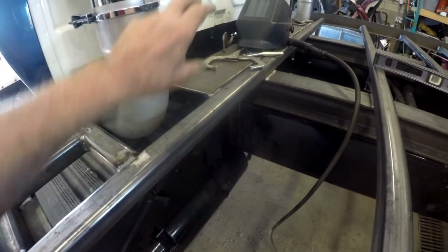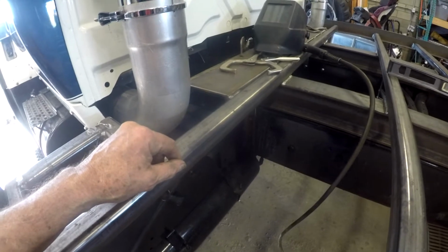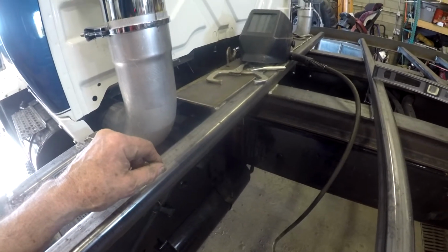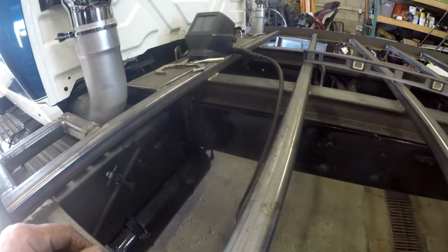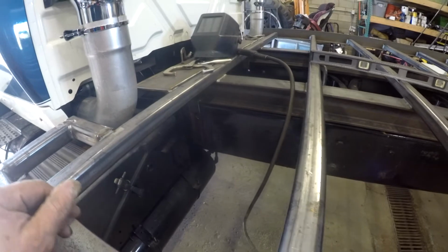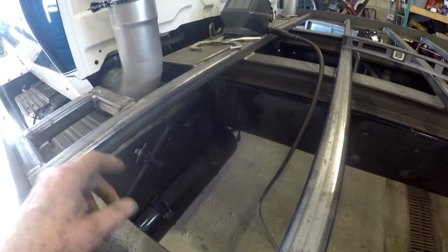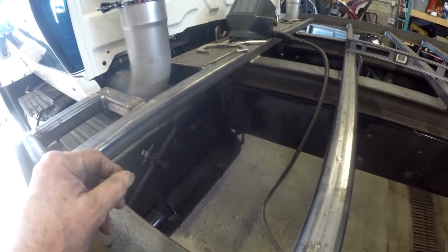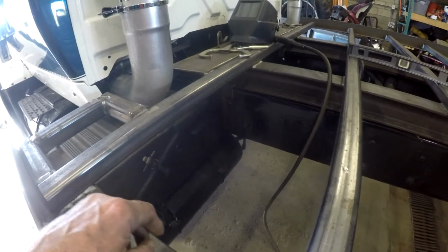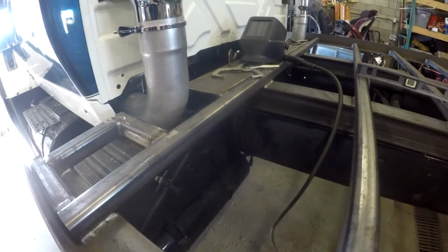So in other words, I'm going to have angle iron, and what I'll do is weld it out all the way around it on the bottom, just so it's a little bit stiffer. I might even put a gusset in there on both sides just to assure that it's going to be very stable. But it should be. There shouldn't be any issue with it as long as, I think it's 4-inch or 3-inch angle iron, and it'll be welded out on every side. But just a brief update.